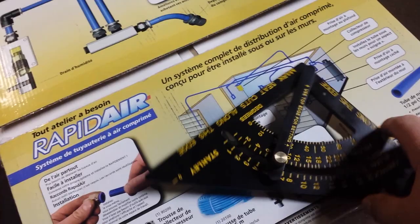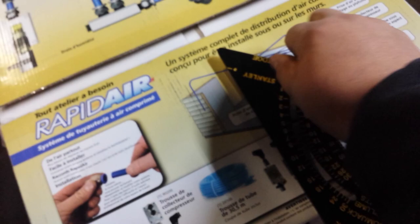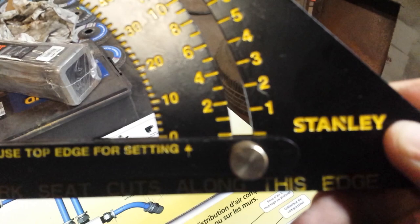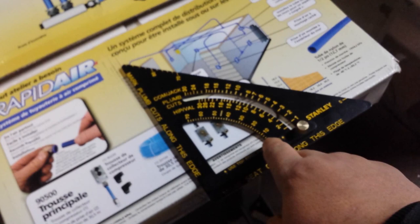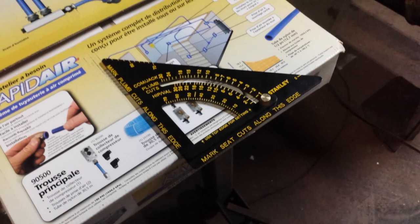One thing I'm going to say to you guys — and my co-worker complained about this a little bit. When you loosen this up and set this arm all the way to a stop and tighten it up, it's not 90 degrees. It's too far down. If you look here, you see the zero mark? The arm is just below the line. You need to raise it up so that it is right on the center of the line and it will be at a true 90 degrees. So just keep that in mind — you'll have to get used to where exactly you need to set this edge of the adjuster in relation to the actual degree line you're measuring to.